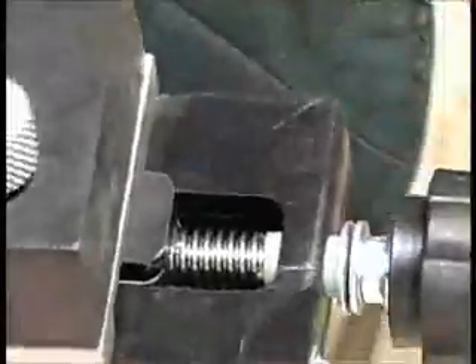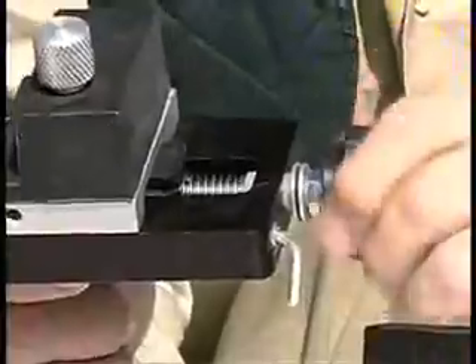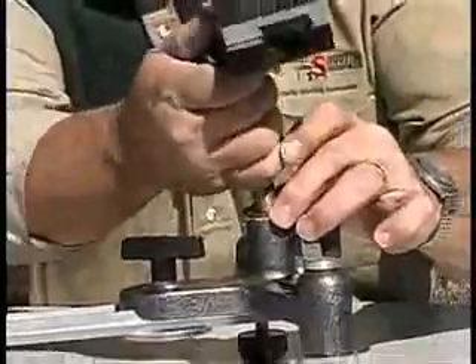This is a t-rail made out of UHMW plastic. When I used it a little bit ago it had such a nice feel — not like the dime-store stuff I've shot off before. The reason is that with UHMW plastic your tolerances can be very, very tight up against the aluminum block, so everything is silky smooth. Dropped in here, we have a little thrust bearing for height and elevation adjustment.